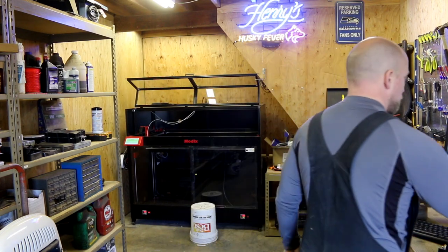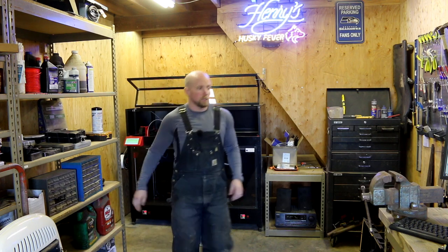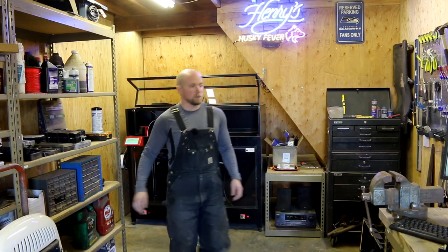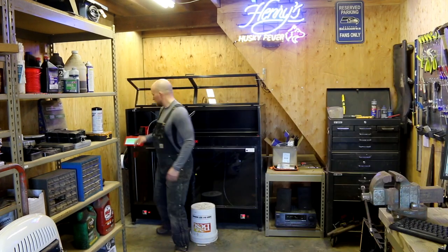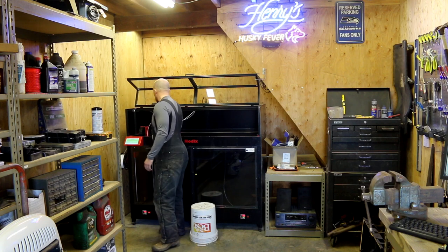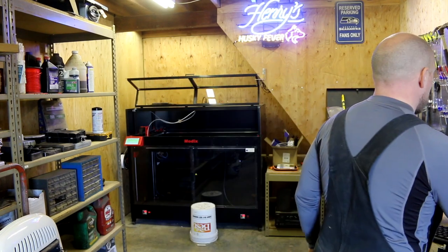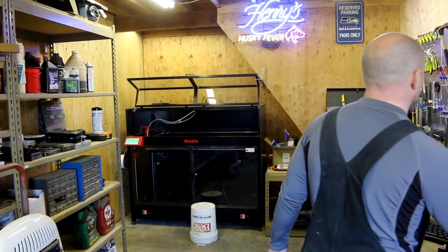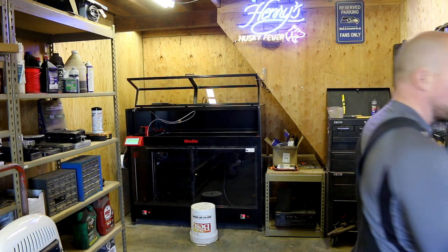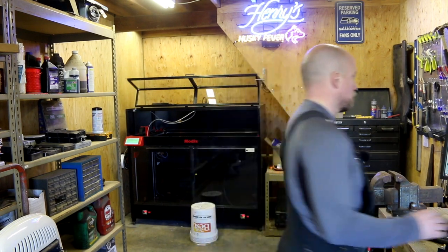Getting my steps in going back and forth — there we go, we hit it. Now backing off a little bit — too tight. Using a smaller increment to really get it dialed in. There we go, that's it right there. Hit okay — that tells me to remove the piece of paper. I'm going to write on this that it's our 1mm head and note the offset.